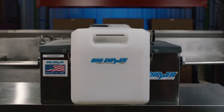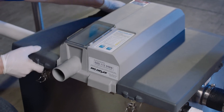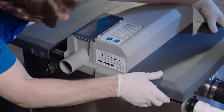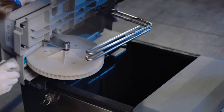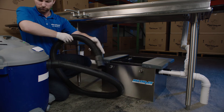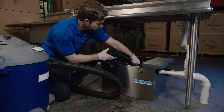To perform this cleaning in-house, follow this method: remove the grease collector, remove the lid, unplug the electrical assembly and set aside. Using a wet vac, pump out the contents of the tank — remove the filter from the wet vac before pumping out liquid contents.